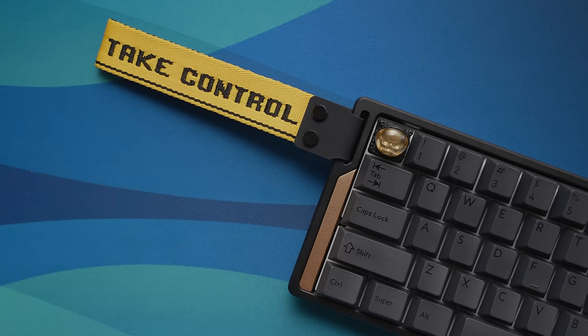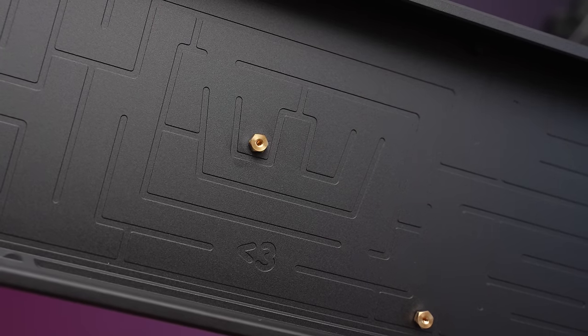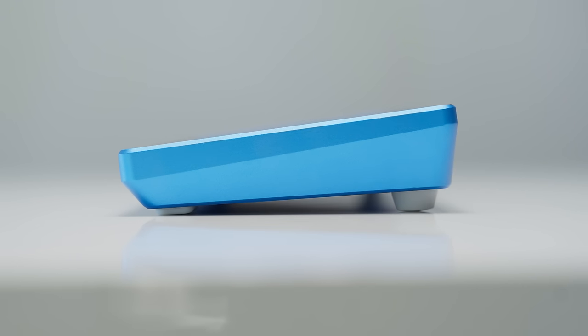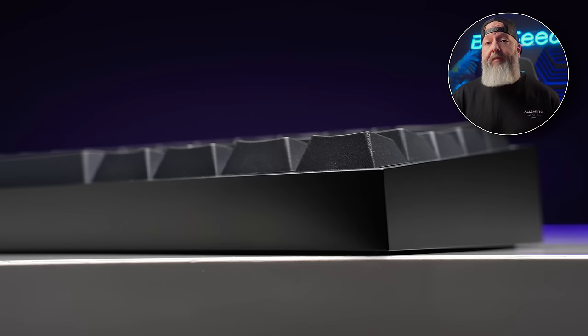I love it. You can use the original yellow strap that came with your board, or they include a black and white mono strap with the new cases. Outside of aesthetics, there are two optional standoffs — one in the center and one by the space bar — and they give us a way to change the board from 4 degrees to 7.5 degrees just by swapping out these rear silicone feet. The Alumaze case and the Redux case both have a front height of 20 millimeters, and some people find that, combined with the 7-degree typing angle of the Redux, to be uncomfortable. The Redux doesn't have any option to change the angle, so that's something to take into consideration if you like a lower profile.